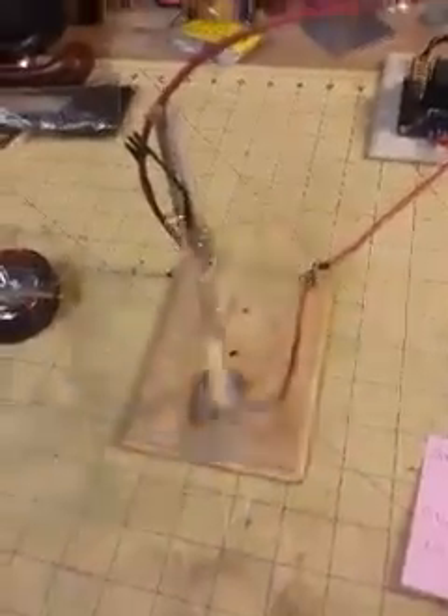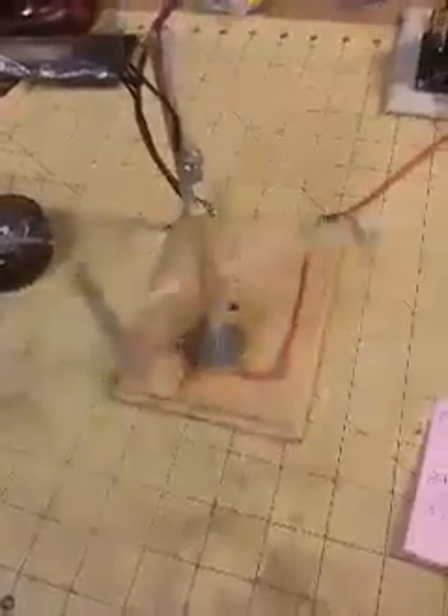It's moving all on its own, and I really think it has to do with the electric field. My next build: I'm going to make one using an exotic semiconductor material called barium titanate. Right now polycarb is what it's running on as the dielectric — just Lexan, with a dielectric constant of 2.9 to 3. Barium titanate has a dielectric constant of 7,000 to 15,000 under certain temperature constraints. They're using it now for semiconductors and piezoelectric speakers, and it's available for purchase.